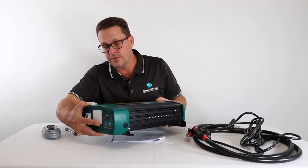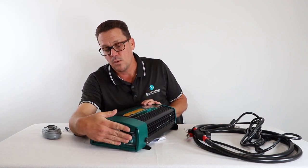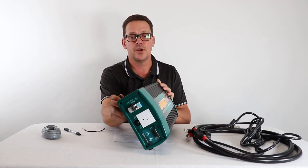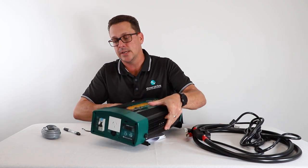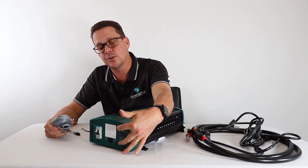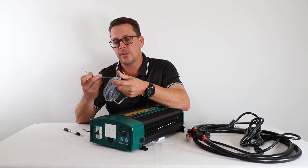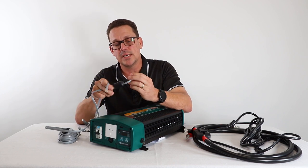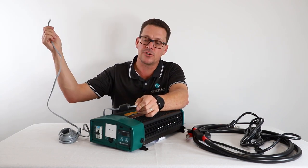Another key benefit on the transfer model inverters is the control panel. It can be mounted in a couple of ways — as-is, or rotated for a vertical installation. We also supply an extension cable: the control panel simply unscrews with two screws and you can run the remote cable through your van, boat, or canopy and mount the screen wherever needed. This is especially useful when inverters are installed under lounges or in tight locations.